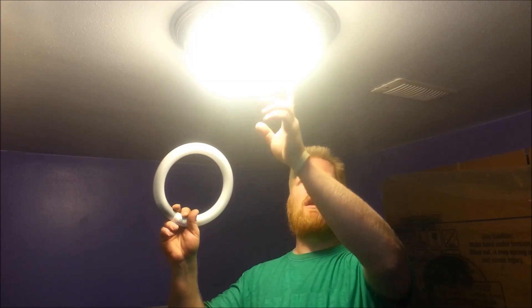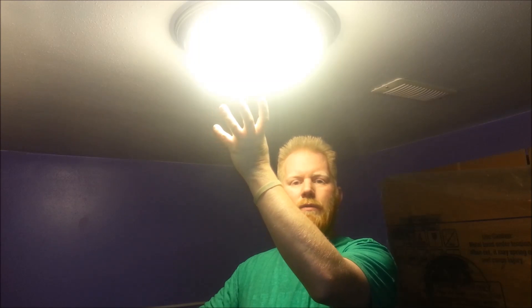These bulbs actually put out more light than the old one did. I'm getting about 3,000 lumens out of here, while the old circline only put out about 2,000. I am drawing an extra 16 watts of electricity, which is very nominal — you won't even notice that. But I ended the battle with buying those expensive circline bulbs and their ballasts, which are 20 to 30 bucks, and the bulbs themselves are 10 to 30 bucks. Now I can put CFLs up in there, which are dirt cheap — around 50 cents a piece, sometimes 25 cents. And I can switch out one if it burns out. Or if I really want to spend a lot of money, I can do LED bulbs, though you might need a couple more of those because they don't really put out much light at all.